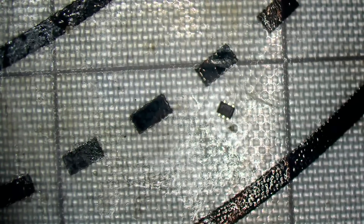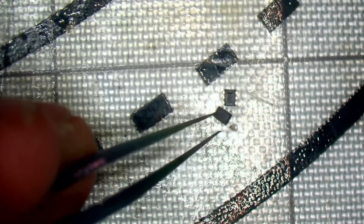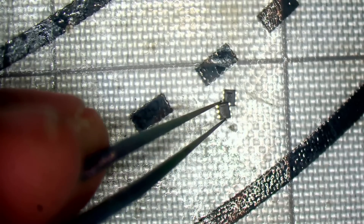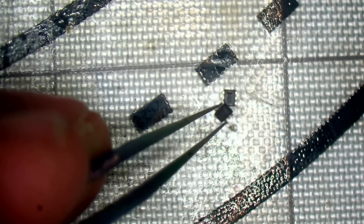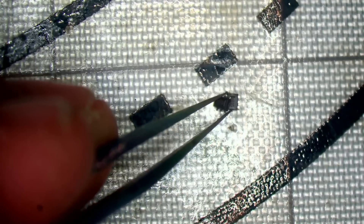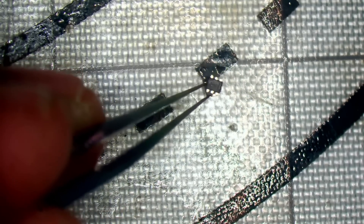These are called diode packs - basically two diodes in a small IC package. Those diodes go from the USB port to these diode packs and then to some filters. When these go short, they cause docking issues and can cause random charging issues as well. On the HAC-10 boards I remove these and don't put them back. It's one less failure point on the board. If you look on a HAC board, they got removed in later revisions.